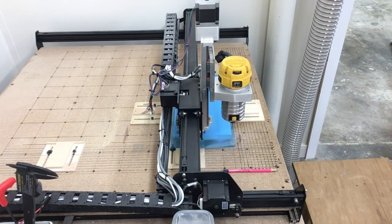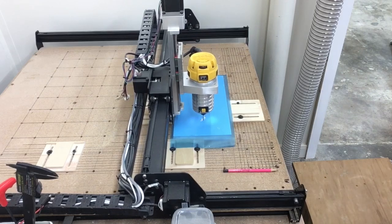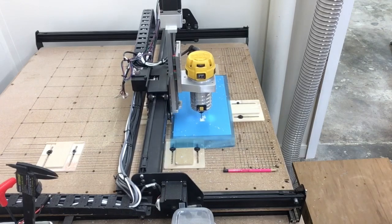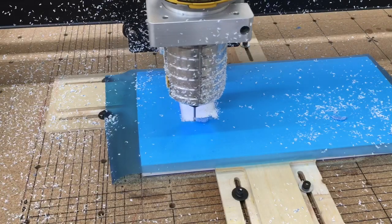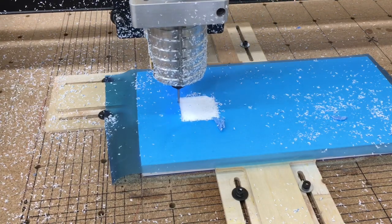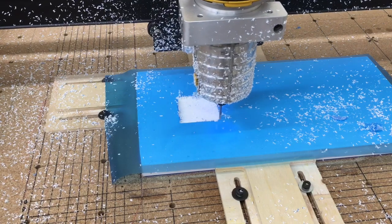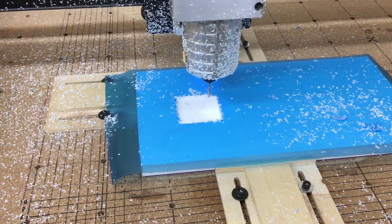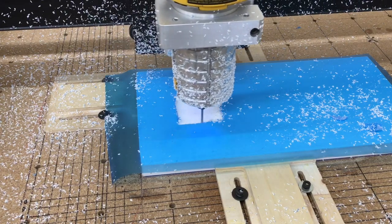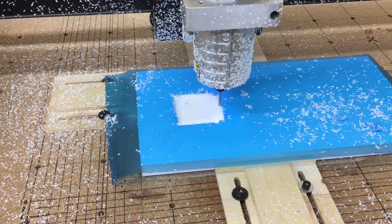As far as the speed of the router — it is on the one setting. That's very important. In very few cases do you ever need to go beyond setting one for the speed of the router. So at this point it's just a matter of watching it go through the carving action. I did set this up to carve on two passes. Just as a reminder, this is carving down at 0.085 inches. The total cut depth is 0.1 of an inch, so there's 15 thousandths that it'll come back and do as a clearing pass, making the bottom of this pocket very clean. That's something to think about when planning carvings — do that little clearing pass at the end in one step rather than having to come back and do it as a separate step.